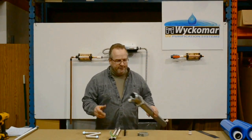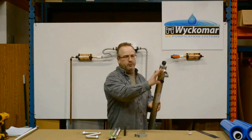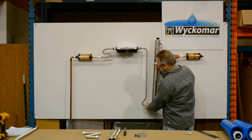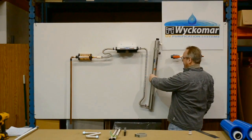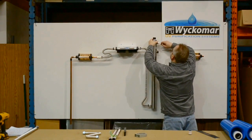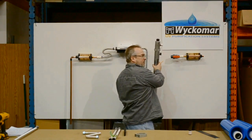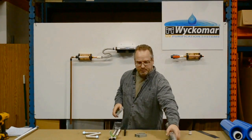To install the UV chamber, take one of the pipe mounts and put it on the UV chamber between the two fittings — it helps hold the unit up on the wall. First connect the bottom flex pipe that we just installed. Space the UV chamber properly and make it straight. Once you've got it straight, mark the center of the pipe holder and the top of the pipe holder — that will allow you to install the pipe holders on the wall simply and easily.